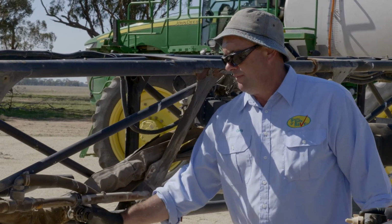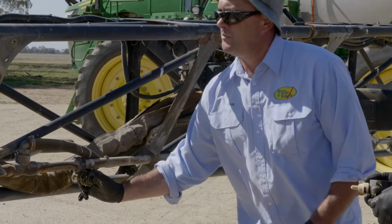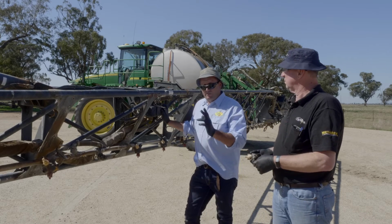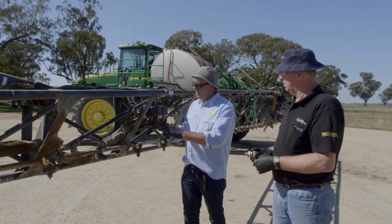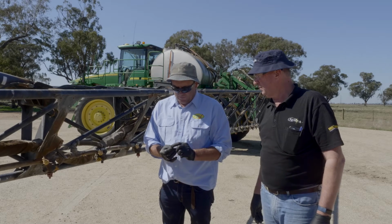So when we are in the cleaning process, and we're talking about these motor valves here, which are our section controls, we've got the sprayer running. Turn sections off so that we're at 5 bar. We've got it running up. Then we want to turn sections off to pulse these lines a bit to get all this pipe moving. So we've got an 80 mesh filter there, I suppose.